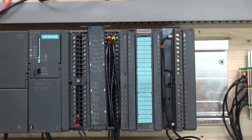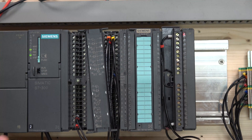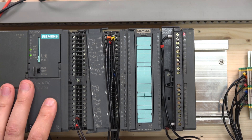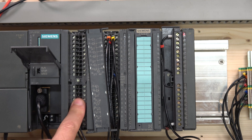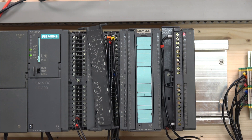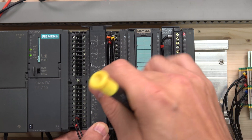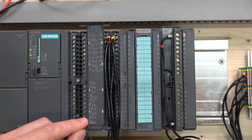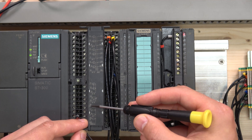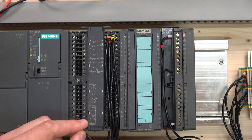So there's a lid from the actual PLC, and these two analog channels we'll be talking about are integrated within this PLC. The power is received from the actual PLC's input, so that's what's powering this part of the card. Usually if you had a separate card, a line and neutral would have to come from a separate power supply to the card, but in our case we don't need to do that. For this particular PLC you can see things like terminal 16 marked V, terminal 17 marked A, then again V for 18 and A for 19.